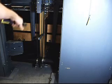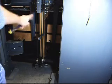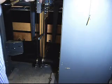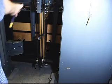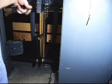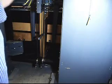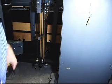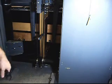I may have said it in the past, maybe I haven't, but my bolts that I put on that black belt, or the transport band assembly, the belts that run it, I've actually tack welded them on the other side, because my associates most times they'll break them loose, take the guard off, fix whatever they're doing, put it back on, and they don't tighten them back down. The bolts end up falling off, the guard falls off, the bolts get kicked around. So I just tack welded mine on the inside. They always stay there. They're never going to come out, unless you grind it down, then you could remove them if you need to for some reason.